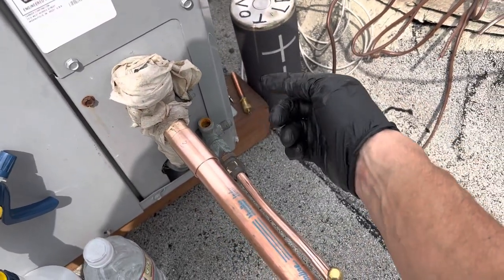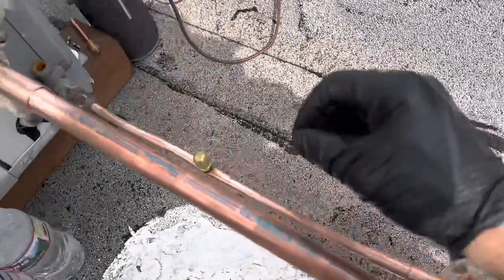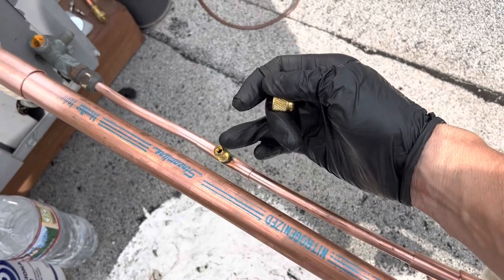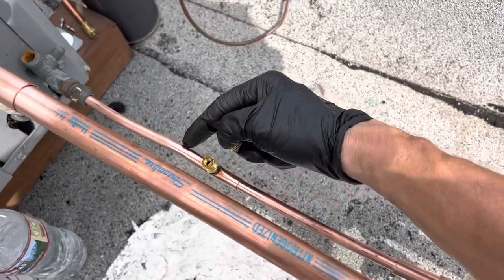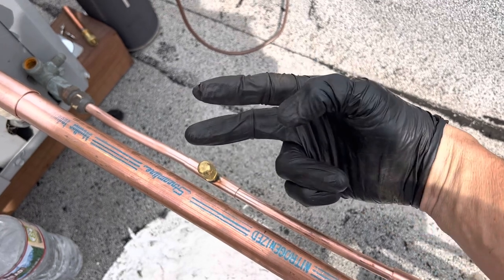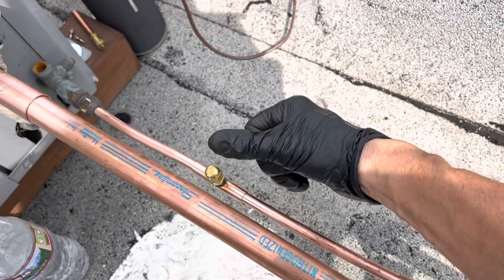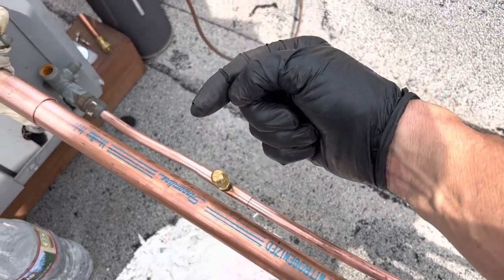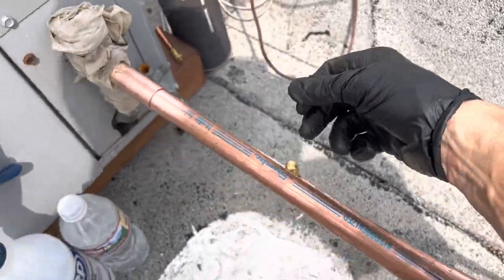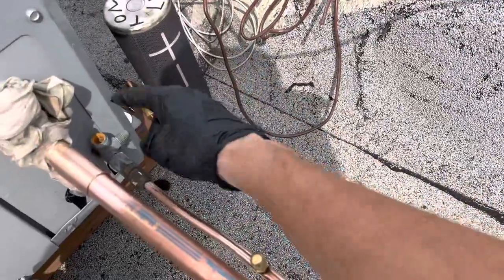Those are all possibilities of compression fittings that have more possibilities to leak. So if I could narrow down my compression fittings to one by using a brazed-in piece right there, then I know I have one chance to leak — actually two. You have your compression fitting that can leak, but your valve body from inside up through the casing, the epoxy inside through the wires — the sensor itself can fail inside the case. Because I'm down to two, not three or four or five.